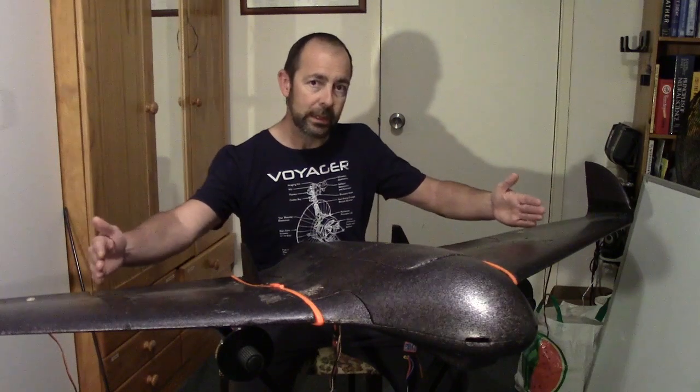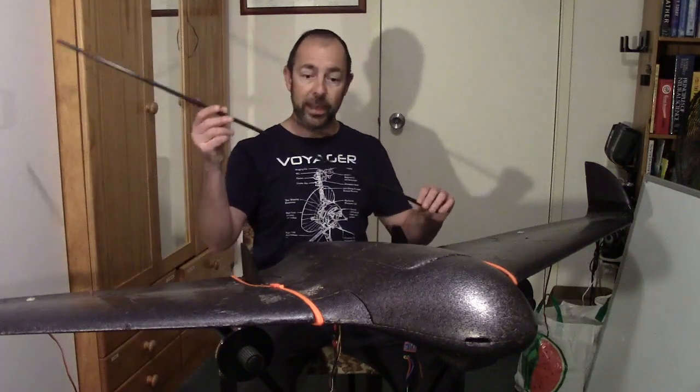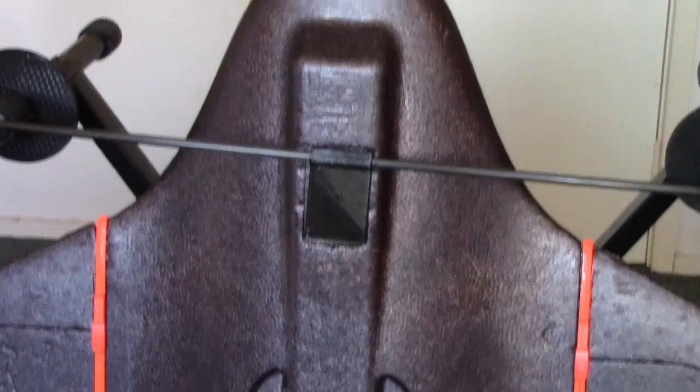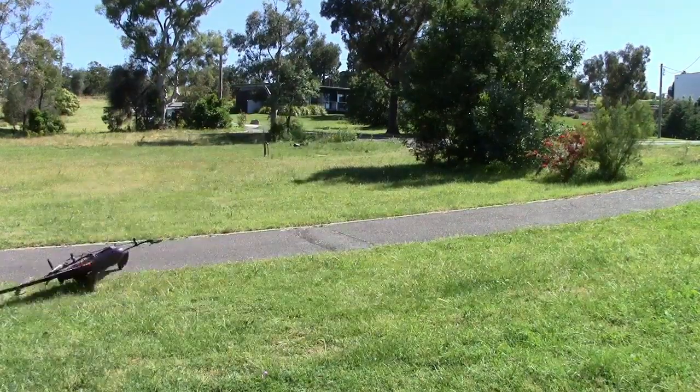The first fundamental mistake I made was mounting the arms for the quad motors quite far out on the wings in order to get lots of roll authority. However, the wings aren't very stiff out there and would bend a lot under the load, which meant that I've had to put in first one, then two, then three lengths of carbon fibre to stiffen that up, along with the corresponding 3D prints. And so all of that added a lot of extra mass.